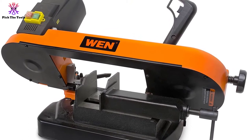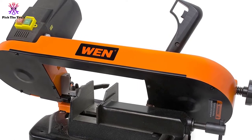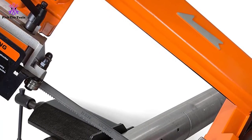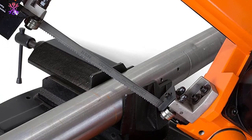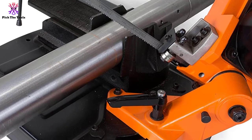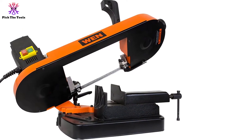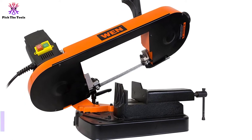Whenever you install your material on the table, adjust it to an exact angle for proper sizing — whether it is a metal pipe up to 5 inches or rectangular sizes up to 5 by 4-7/8 inches. Variable speed operation permits blade rotation anywhere from 125 to 260 feet per minute. You can cut more than 24 inches of metal at a single pass with the two-speed blade of 125–260 FPM.